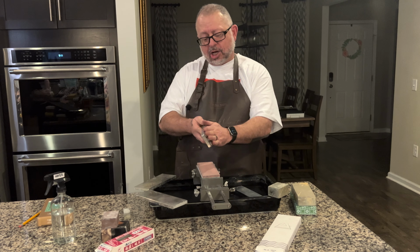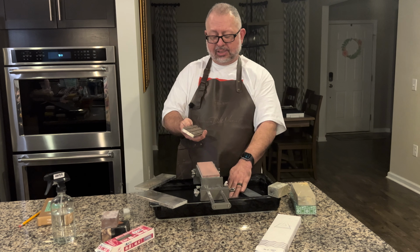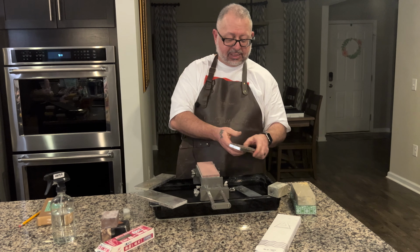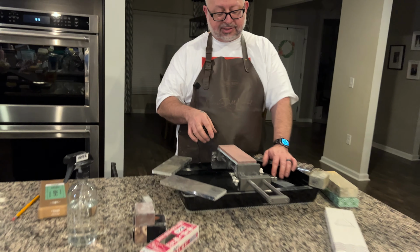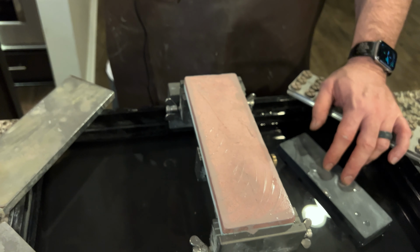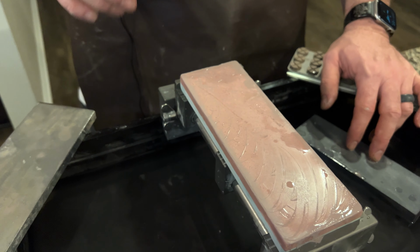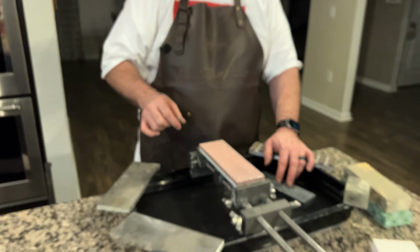Just like all steel and everything like that, remember that things can rust. Make sure you clean it up and get the abrasives off in between. But we've got a nice slurry. We've got most of our lines gone. I didn't try to get all the lines gone because I wanted to show you some more things that are out there. I'm just picking up the little swirly lines. So we have had the diamond lapping plate, the super high-end Nanohone. It's an American-made product.